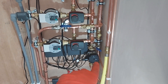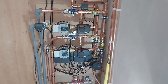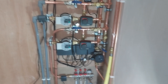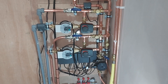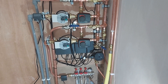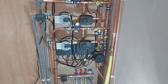I'm always going on about not using an unmixed circuit for radiators, and that's because radiators are nearly always in bedrooms. But in this house they're not — the radiators are additional to the underfloor heating in the living room, because they've got a decorative fuel effect fire which is rapidly pulling all the heat out of the room and sending it up the chimney. So we have to put stacks of extra heat into that room to counteract that extra ventilation — five air changes an hour is what they say for a DFE.